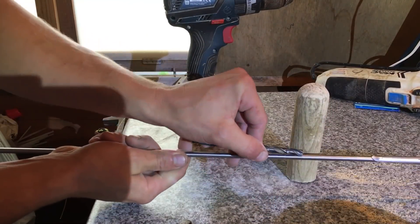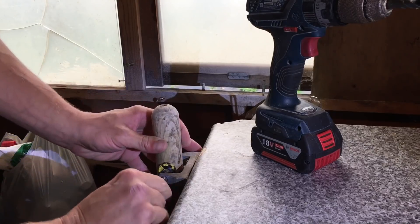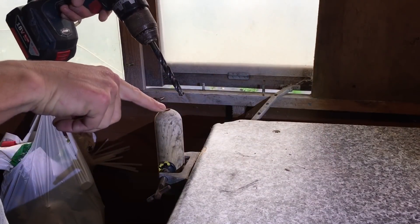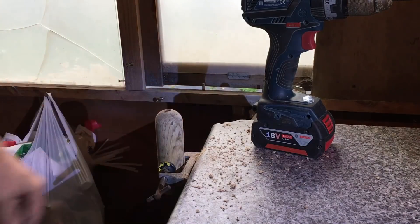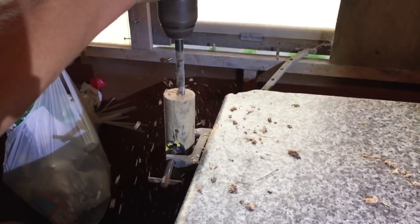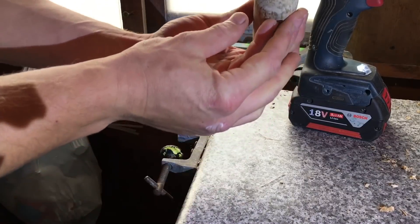When you're choosing your drill bit, you want it a little bit bigger than the actual tube, just so this part is nice and tight. At the bottom we're going to be drilling a much bigger hole, and that will become apparent as the video goes on. Get it nice and tight in a vice so you can see straight down it and get it as accurate as you can. I'm going straight down about halfway through, then I'm going to flip it and do exactly the same on the other side until both holes meet up. That's the hole drilled out now — straight through it.